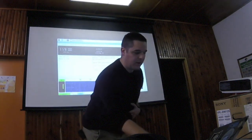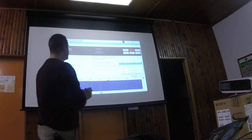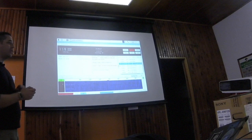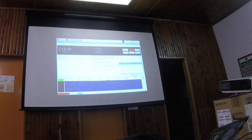Since Pete said he's just going to leave his on auto, I'm just going to send, as I said, the automatic grid. I've just sent the command grid, and it's pulled the grid that I'd programmed before, QF44NP. At your leisure, go to aprs.is, search my call sign, VK1MIC, and I think there should be a -15 appearing on there now, and that'll be us appearing on APRS.